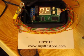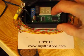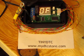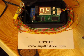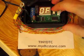It also has a freeze protect mode. It's set for off right now, but you can turn it on. This will force the output on if the T1 temperature goes below 35 degrees F, overriding all your other set points. It's to keep your pipes from freezing. I don't recommend running your unit outside when it's below freezing, but if you've got the right setup, the right materials — antifreeze or whatever — then you should be okay with that.